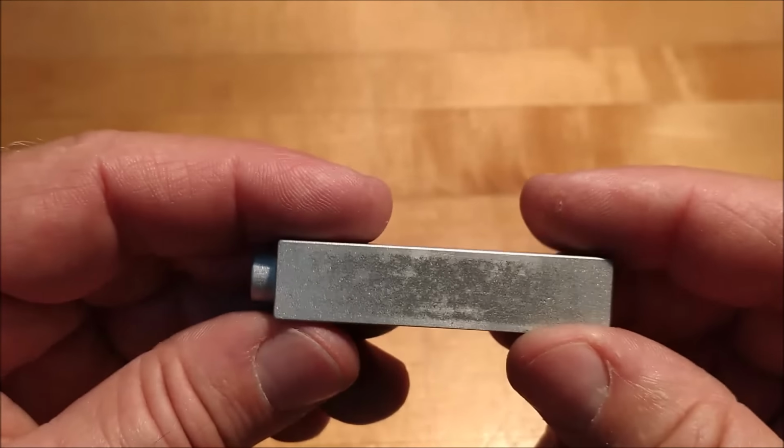This is going to take a while. I'm going to wind it up. I'm going to have to make two passes, maybe even four, up and back. And I'm going to raise the tool up 5 thou to give me the adequate vertical dimensional thickness of the slot. And we'll go from there. Here we go.